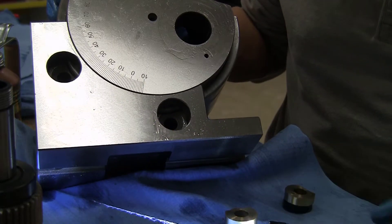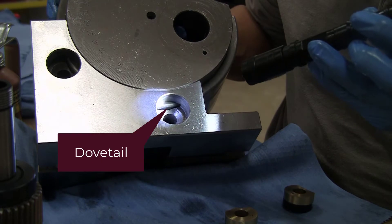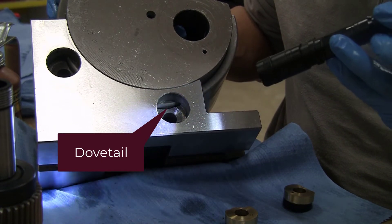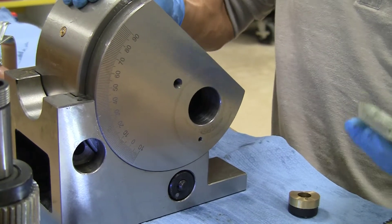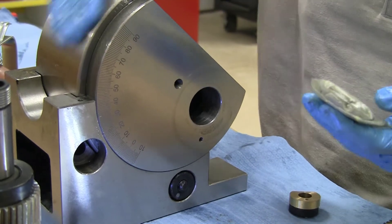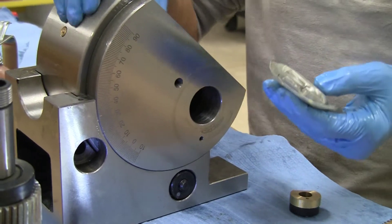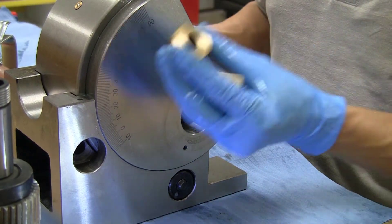Now it is time to add the clamping nuts. These are made out of brass and you can see where they apply pressure to the dovetail just inside that hole. The shaft is threaded on both ends, so this end goes into the brass clamping nut. With just one nut installed, tightened with light finger pressure, it is already hard to move the dividing head.